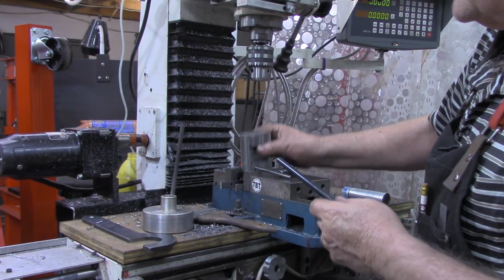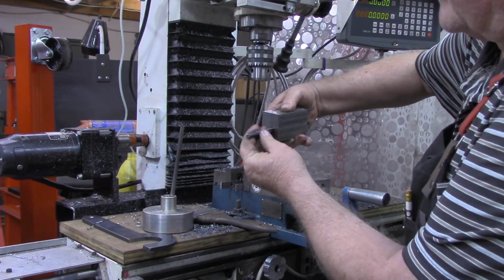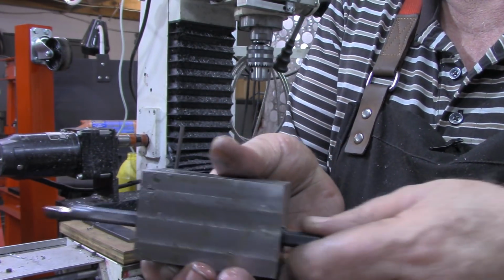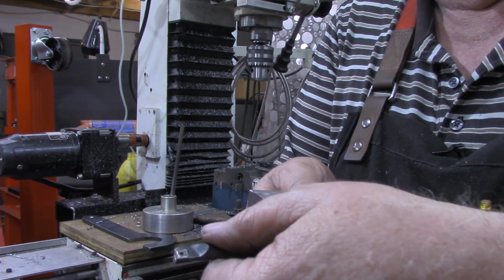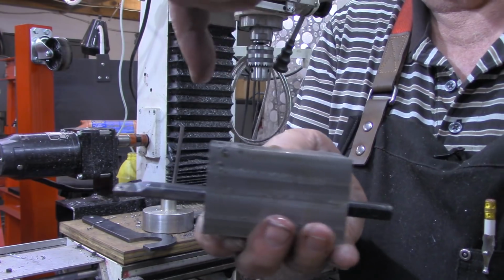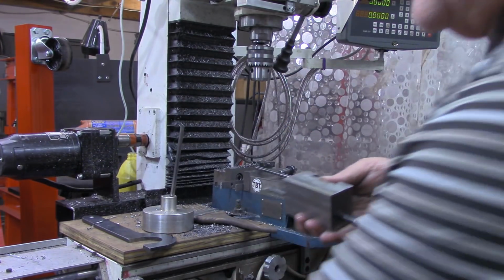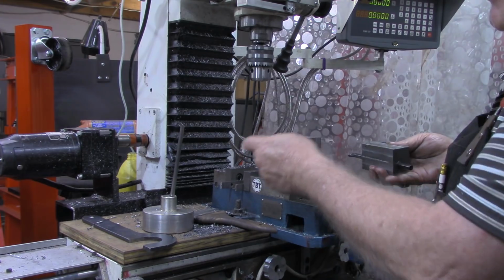And this was the 3/8 boring bar right here. That goes in there fine. Next thing, of course, on them will be drilling the holes in the top to secure them with. And of course, by putting the dovetail on the wrong side, that means I've got to have some longer set screws in here than I was planning on. But I'm going to get the other one drilled now, and then we'll get set up to drill and tap